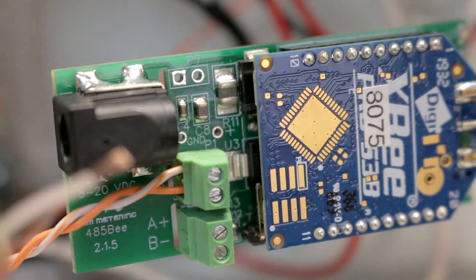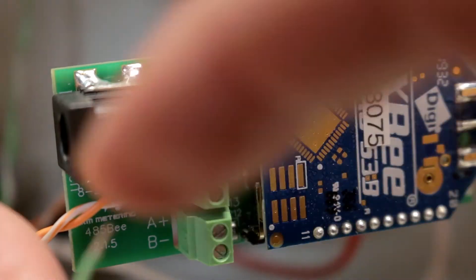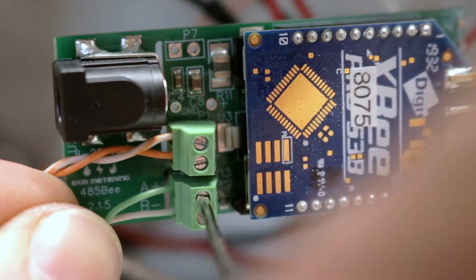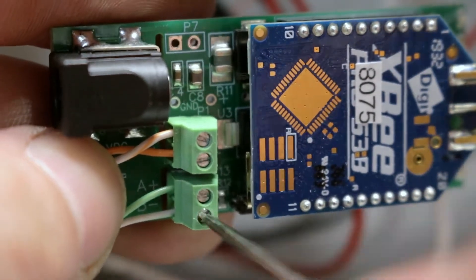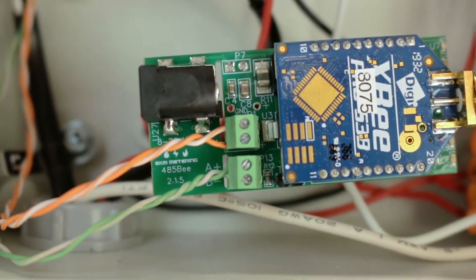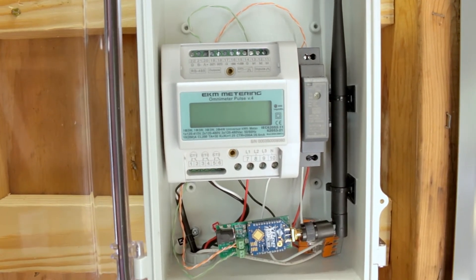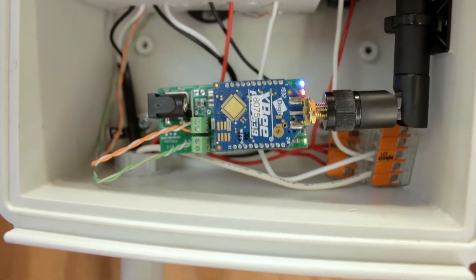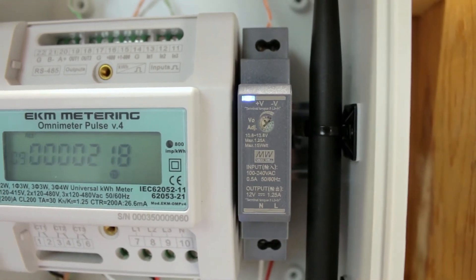Our power wires are in, so now we're going to do our green twisted pair, remembering that our positive, or A, is the solid wire. Here is our completed antenna with power on the top and communication on the bottom. The next thing we can do is go ahead and power this unit up. With it powered up, you're going to see a green light on your antenna indicating that you have power there, and also a blue light on the power supply.